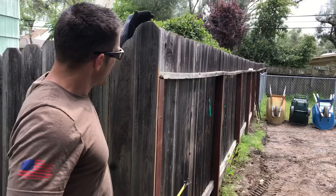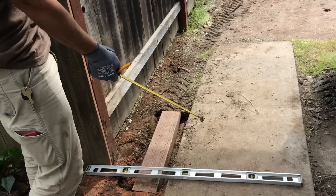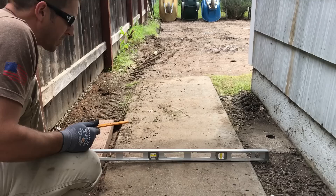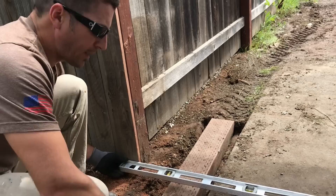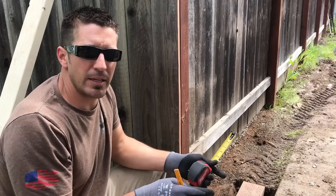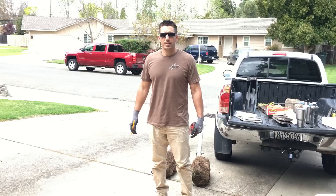The boards we have are 72 inches, which is pretty standard for fences. But if you leave the gate at 72 inches and mount it, it's going to be taller than the existing fence because the concrete is higher. So you always have to double check your ground — in our case it comes up about 7/8 of an inch from one side to the other. We transfer a level line to the side of the fence and measure from there to the top. That tells us 70 and a half would be a good length, but I'm going to go 70 inches for a little more clearance so it can swing. So we're going to cut basically two inches off the bottom of the fence boards.